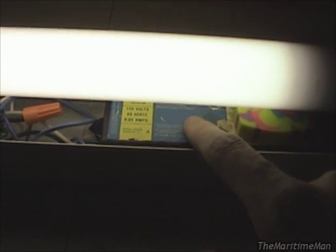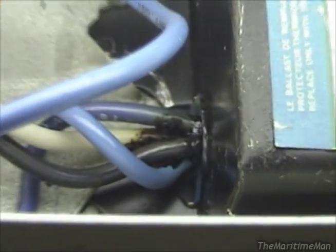So if I were to let this run too long — which I actually did last night — the ballast got so hot that you could hear the tar inside it boiling. Luckily, I unplugged it before the thermal protection tripped. This ballast has automatically resetting thermal protection, but yeah, I wish I hadn't done that. If you look down there on the wires, you can see a bit of black — a tiny bit of tar did leak out. I should have been more careful. I expected a rectifying lamp to not cause such harm on the ballast.